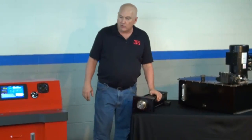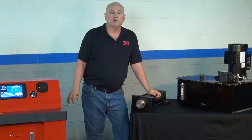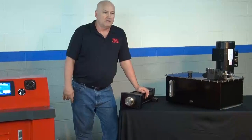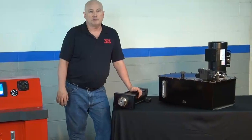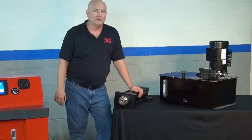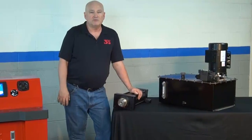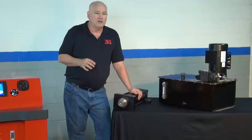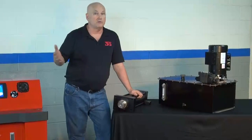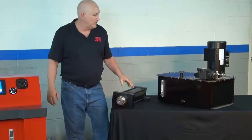The cylinder is powered by a five horsepower motor rated for 24/7 operation. It's a three phase motor. We can supply a single phase motor; however, expect a huge price increase — it could be as much as $1,000, because once you get up into the higher single phase motors, the price just seems to go through the roof. So if you have a problem getting three phase, you may want to look at a three phase converter — it's going to be much cheaper than us setting up a single phase motor for you. However, we can do it.